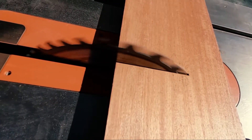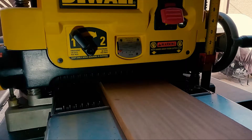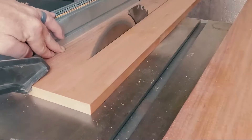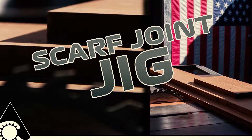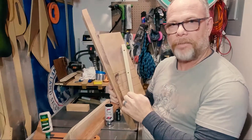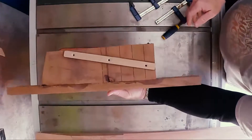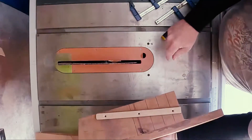The first thing we've got to do is take this piece of wood, run it through the table saw, and then run it through the thickness planer just to clean it up and get it down to the size I want, which is basically about two and three-quarters inches wide. It's got a little runner on it so that we can run it into the grooves on the top of the table saw. Because it has the runner on the bottom, it's going to feed into the slot and keep it consistently at the angle we need.